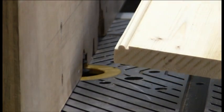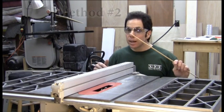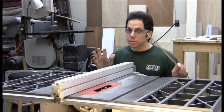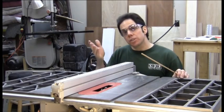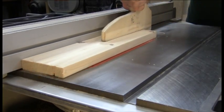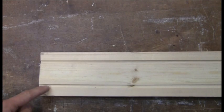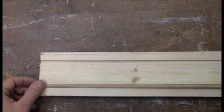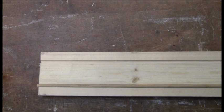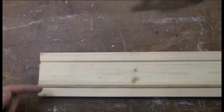Using the router is probably the quickest and fastest way to make your bead molding, but it's not the only method. A cheaper way this could be done is by using your table saw and a dowel rod. I'm using a stacked dado set, but you could do yours with just a regular saw blade. The groove should be the exact width of what the dowel rod is. Once you're done making your cut on the board, you simply drop your dowel rod in — it makes a nice bead molding. What I really like about this method is you can put the bead anywhere you want on the board.